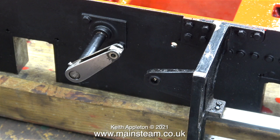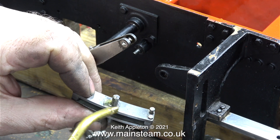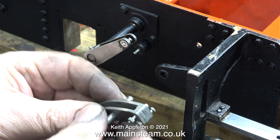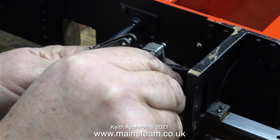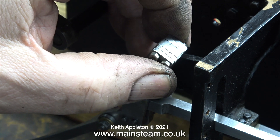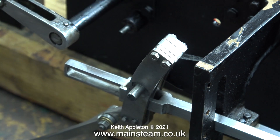The first thing to look at is the die block in the lifting arm. Initially I left this in the lifting arm so I wouldn't lose it, but now it's time to remove it and fit it back in position in the radius rod. But first a bit of oil on the expansion link bearing. You will see me lubricating the parts frequently because this has been through the parts washer and steam cleaner, so any bearing surfaces on the chassis will be very dry.